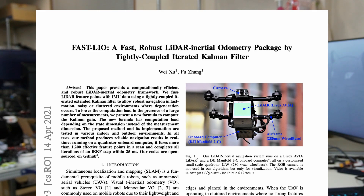Next, I assembled the mount with the Mid360 using M3 screws, then attached the slider on the aluminum frame of the AT crawler. Here is my setup with the Livox Mid360 on the AT crawler. The LiDAR is placed at the front with an offset from center, but we can correct that in the odometry data through software.